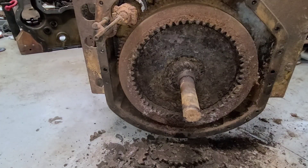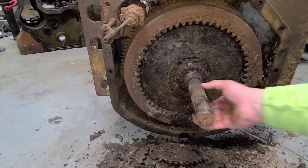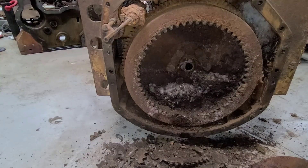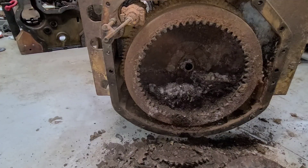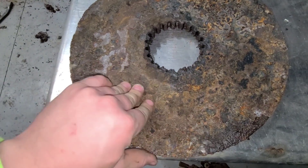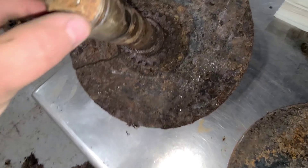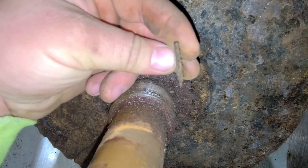With the better majority of what's left of that disc down on this pile here, we should be able to remove this. After looking at this disc, I think we're on the road to looking for an entire new clutch. As you can see, we have fairly deep pitting. A lot of this is bubbled up rust. It may clean up, but you're going to have a lot of low spots in there. Over to this one here — it's quite the same story. You know, your disc surface there — I can peel chunks of that off.